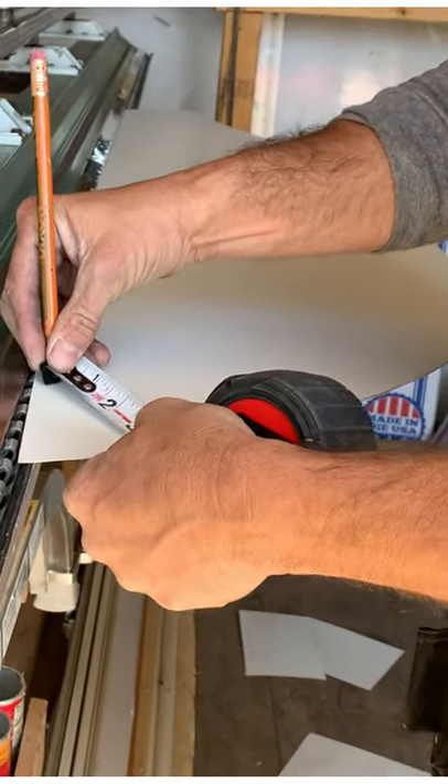Like I said, if you've got a 3-1/2 inch face you're wanting to put a keystone on — 3-1/2 inch arch, 3-1/2 inch header — go to about 4-1/2 inches wide and bring it in about 3/8 for your folds. Be a good judge on your angles; you don't want to angle too much or too little.